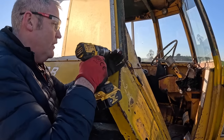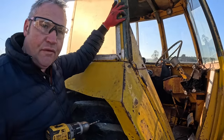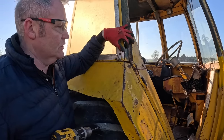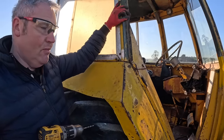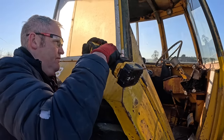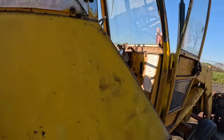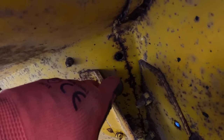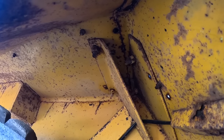Little hole here now - you take the wire, checked in here, there's no pipes or cables running up this. You also have to be really careful even when you're cutting the frame for the door - you always have to be careful there's no wires, because a lot of the wires in modern tractors and pipes for heating go up these. Don't ever bore into something unless you've checked. Now that we have that hole drilled, I'm just very lucky that straight down there's already a hole right underneath it - must have been there for a wire previously. Anyway it goes straight up so that's going to make life easier for me.